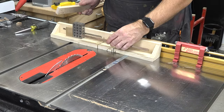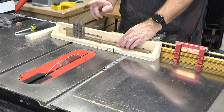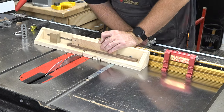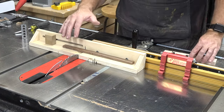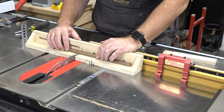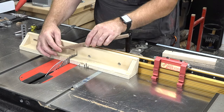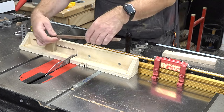So when you go to set up for the cut, you'll place your 1-2-3 setup block against your stop block, place your stock against your setup block, and then you'll lay your scrap to hold your stock down. You can then remove this. And what this does is, as you follow through with the cut, it prevents this off-cut piece from binding. If you have your stop block completely up to your stock like that, and as you come through, that piece is trying to lift, it's trying to move. And if you go past to the back end of the blade, this is where the kickback can happen, and it's going to try to lift it. But when it does, it has nowhere to move. So it will bind against your stop block and just snap it sideways.